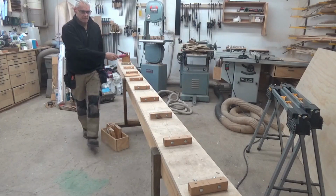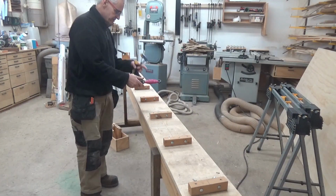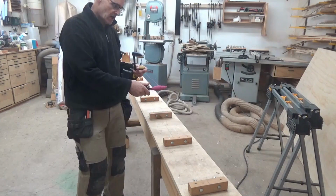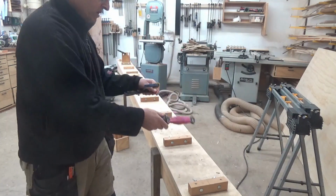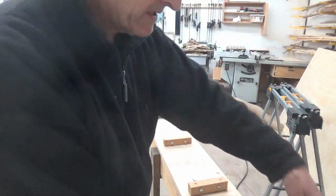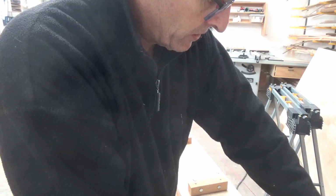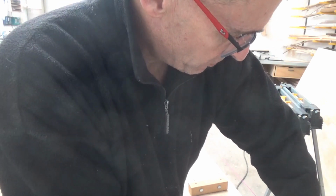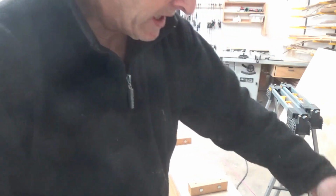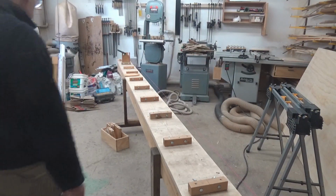Next step is to set up the risers, all relative to the center line, which would be the horizontal center line, and the tops of the risers will correspond with the water line on all of the forms. So I start by setting up the 2 at the ends of the boat. Now I'm not doing number 1 or 12 because those forms are so small, I don't even know how they're going to be held on there. But with that taut string I can line up the rest.